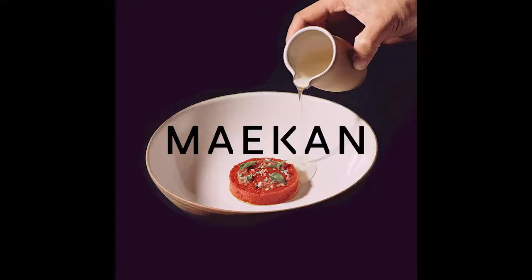Next comes the innovation in question — the jigger, which is a shaping tool potters use to make flatware. Pandolfi's is modified to work opposite from how jiggers typically work. We jigger everything face up. A lot of jiggers work upside down, so you jigger the back of the plate and then you can't control what the face looks like. We can take an eight-inch plate and make it two dozen different ways. This makes intuitive sense — why focus so heavily on the side of the dish the food never touches and the diner never sees?